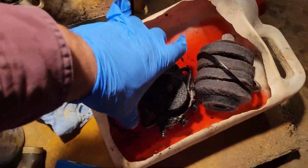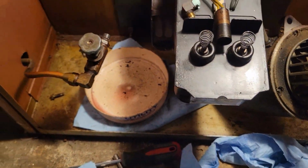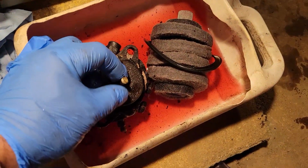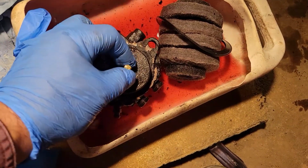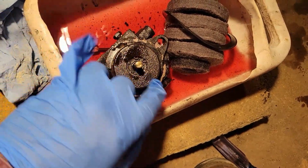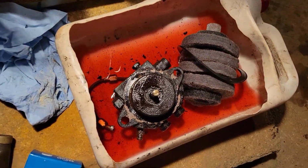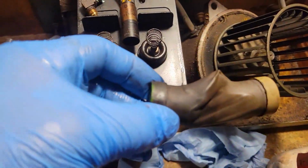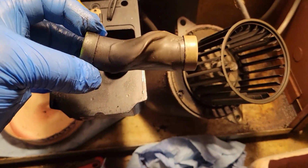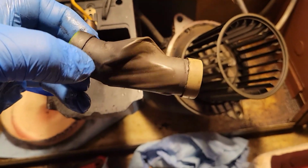Alright, we're here cleaning the furnaces, and I looked and it was all wet in here. So I took the pump off and looked at the shaft. I probably can't see it, but it actually moves, so the pump seal is destroyed. I pulled the coupling out and look at it. Have you ever seen anything like this? It has to have a backdraft on it.